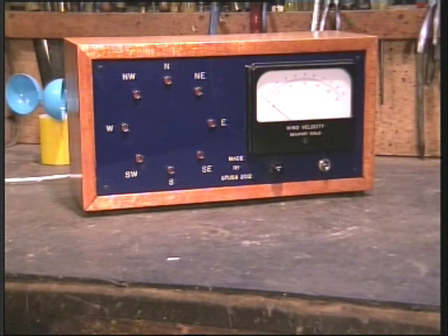For the circuit, there are tachometer ICs available. They are cheap enough to buy, or you could use a 555 timer. I have never been one for a 'chuck a chip at it' mentality, so I have gone for a simple diode pump using just a few discrete components.